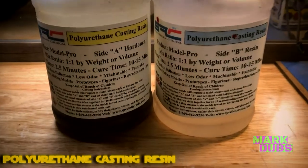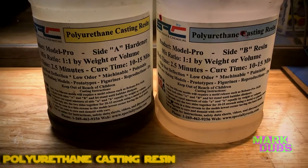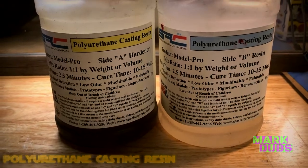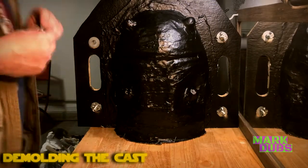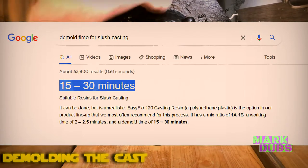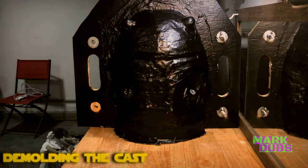The type of resin I'm using is polyurethane casting resin from Specialty Resin and Chemical — links in the description below. Through trial and error I found that for a mold of this size you should use roughly 100 milliliters of resin at a time. Too much resin won't spread thinly enough, resulting in areas that are way thicker than intended. The demold time is 15 to 30 minutes, but the working time is only two to two-and-a-half minutes, so you have to work quickly.